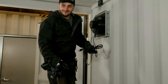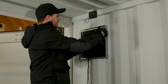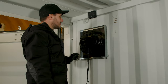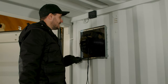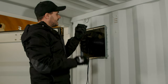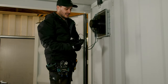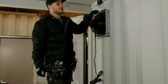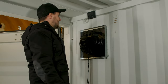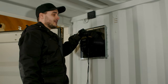This thing's deadly. A lot of times when we're installing these, we're installing them in steel-studded and insulated containers. Now with these flanges I was talking about earlier, we're able to use our steel stud brackets — we can run studs down both sides of this and one across, then take some galvanized angle and trim after our interior wall coverings are on. The controllers are magnetic. You wouldn't want to transport them that way, but we could self-tap into the top tubing to hang them — that'll hold it during transport and keep it up and out of the way. There's also a cord still in the box — it's a temperature and humidity sensor that you could put in the middle of your container. Some people loop it through their D-rings to get it to a centralized location to check the climate and then turn this thing on when it needs to run.